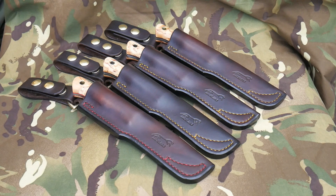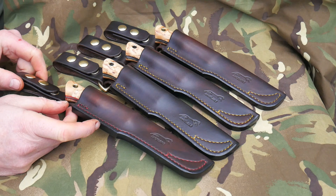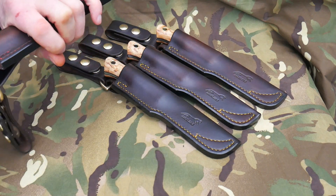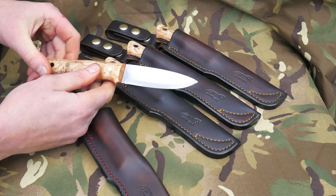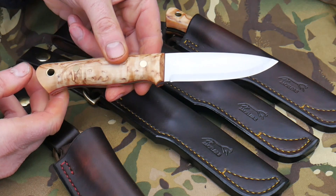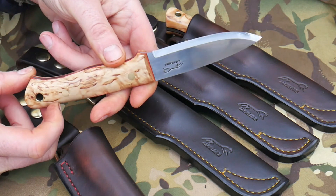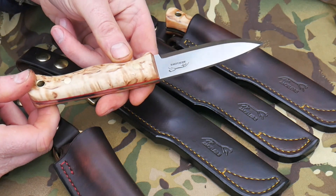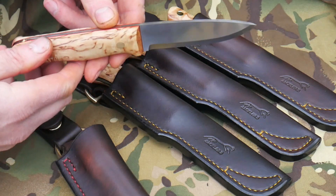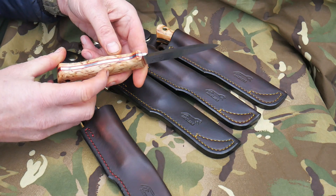That's the four Bibi knives in question. These three are more or less identical; this is the only different one — it's only different because it's got red liners, whereas these have all got black. They've all got G10 liners. I love the Bibi knife — it's just slightly smaller than the classic. It takes exactly the same amount of time to build a Bibi as it does a classic; the same processes are involved. Stabilised handle scales, and I tend to fit all these with Loveless bolts, so there's a shoulder on the bolt inside which gives you a mechanical bond together with the epoxy, leading to a very resilient handle.